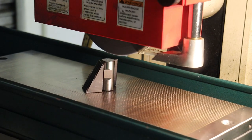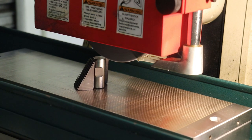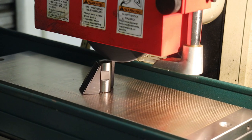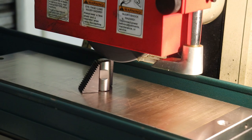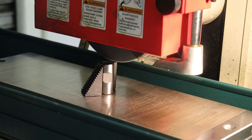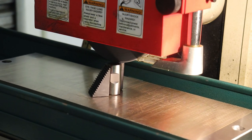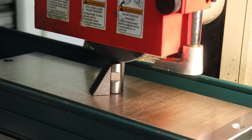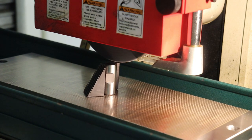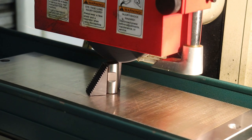Let's bring it down until we're close. And then you want to just pick up the corner of the steel, again, to reduce the initial jamming or over-grinding of the part. And I'm going to start going across, sensing to see if I touch, and I did touch right there. That's the burr from the die grinder, so I know I'm close. So come down a couple more thousandths, and then I'm going to enter slowly until we start to make contact with steel. There again, that's more of just the burr. So I'll come down some more. And there we are, touching off a little more.